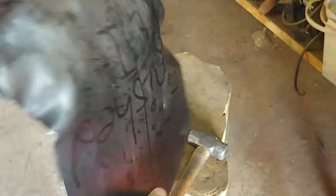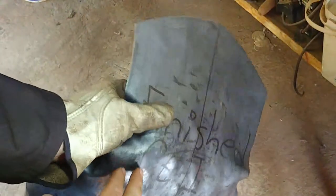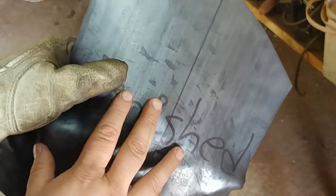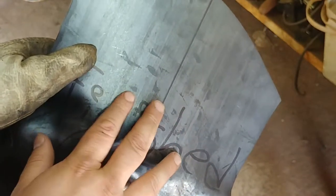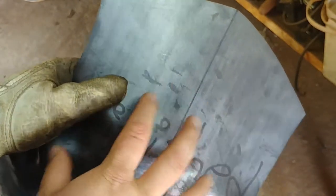Carrying on here, I've got a rough shape that I need for the breastplate up to the chest area. Now where a lot of people may go wrong here is that they make this too curved. Your chest is pretty flat near the collarbone area, and making it curved here causes pressure on the sides of your collarbone, which you don't really want.